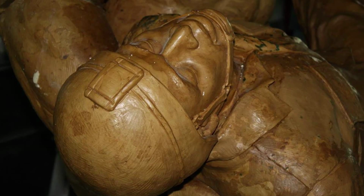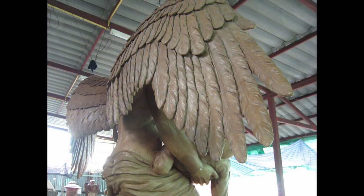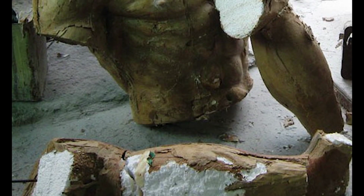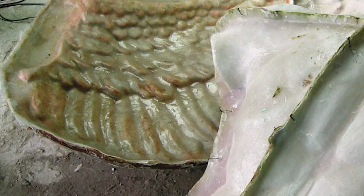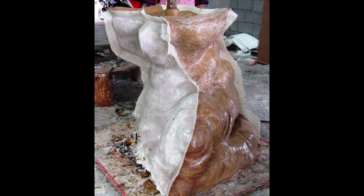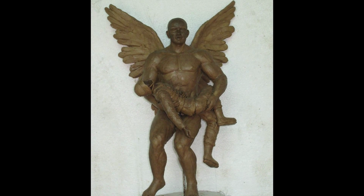The sculpted clay model is covered with silicone rubber. The rubber forms a mold of the original model and preserves all of the surface details of the original. When rubber hardens, it is covered with an outer layer of plaster. The plaster is rigid enough to support the rubber and keep the mold from changing shape when the wax is poured in. When the plaster hardens, the rubber and plaster are removed. The rubber mold is a negative version of the original.